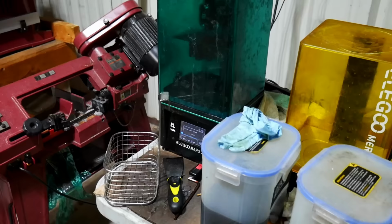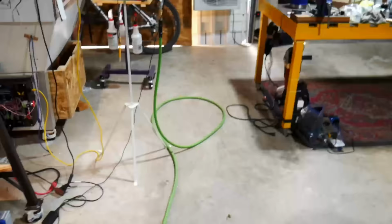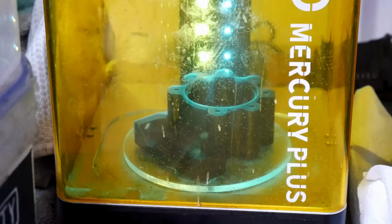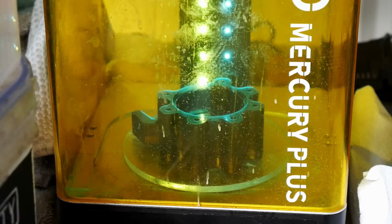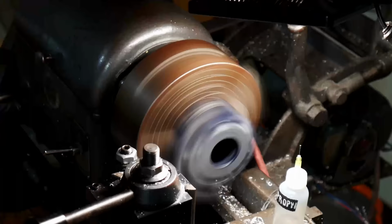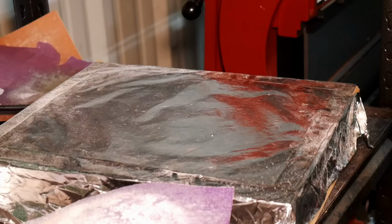Okay, and we're back to the voiceover. So here you can see me doing some 3D printing. This is me pulling parts off and then cleaning them. Dirty clean, then clean wash, and then spraying them off with air, and then curing them in the curing station. And then there's going to be post-processing on them here. And this is, again, parts for the Howlmat. This is after I've done all the prototypes, so that's why I'm showing you this here.